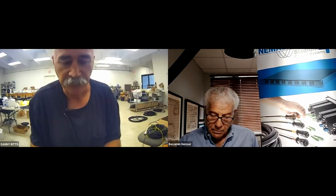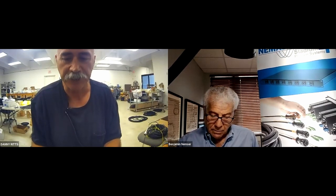So, Danny, can you overdo this by cleaning? I mean, just by time and utilization and getting on site and getting off site and going back on site and using this in the AV world, can you overdo it? I would say that if I was in a high precision environment where I had a couple of patch cords that were my major backbone, I would be limiting the number of times I plugged and unplugged or cleaned it, simply due to abrasion that occurs on the contact. But along the lines of everyday patch cords, no. Leaving the dirt on is 10 times worse than the abrasion that you're going to cause.